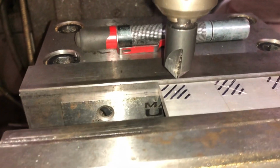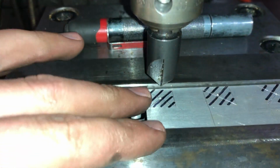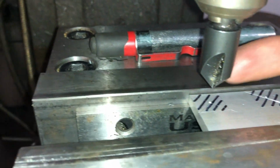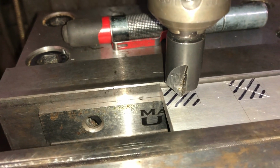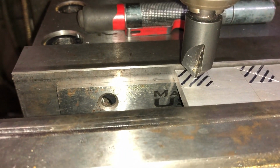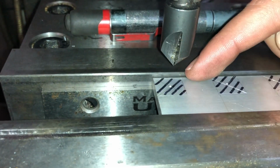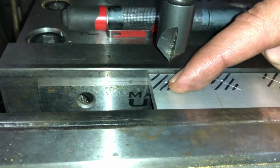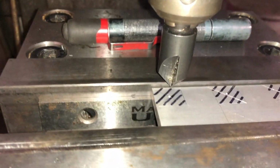I got the one piece grabbed in the vise, and it's sitting on a 3/4 parallel and an 1/8 parallel, so I can grab it up near the top so I can see what I'm doing up here. And I got my little center countersink with a fine tip on the end, and I've lined it up with that center punch that I punched out in the material beforehand. I took a scribe, I scribed a diagonal line this way, a diagonal line that way, and then I felt the center of the two diagonal lines with my punch, held my punch there, hit it with a hammer, got my punch mark. As you can see, I've lined it up